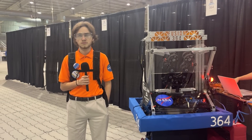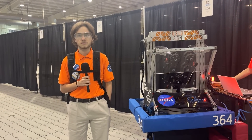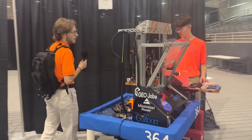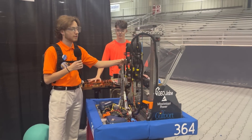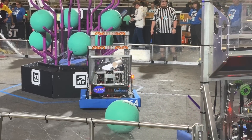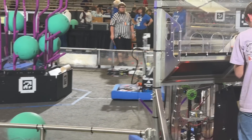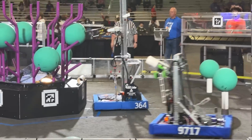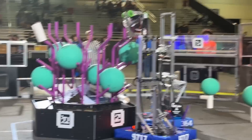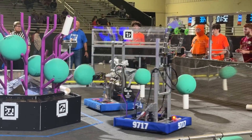So Sean, walk me through some of the mechanics of your robot and how your intake works. Our intake is controlled by 10-pound gas shocks — two of them on each side. Whenever you put more than that kind of pressure on each side, they open up. So basically whenever we have algae in it, it'll open up to this position to be able to hold it. And when that pressure is released, it'll go back to a certain position without any kind of manual control.